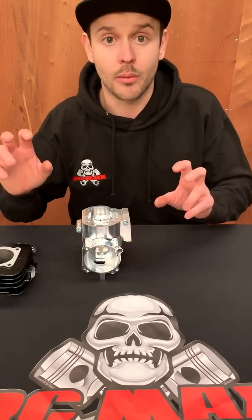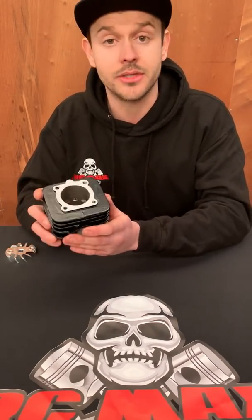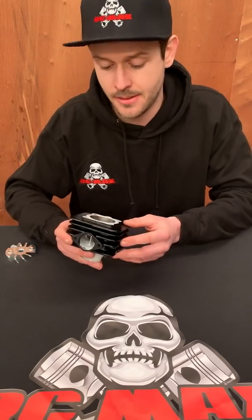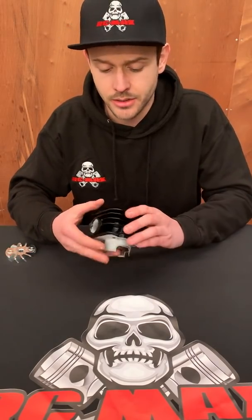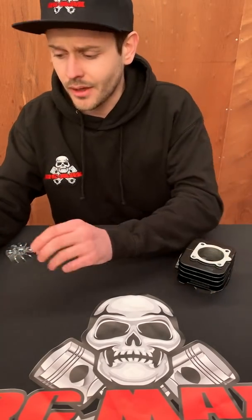The problem is with what we're calling the second tier — the 71-plus. Our supreme cylinder is being used across the board from 55cc up, so we're using the lightweight 47.6 millimeter piston. We're no longer making the 90 GT — if someone wants one, I'll build it, no problem — but we now have a superior option: the 80 supreme. The 71 and 80 are just way too powerful for the 62 millimeter clutch. We experimented with quite a lot of different clutches — steel clutches from 70 to 90 millimeter — and had a lot of problems with heat. Unfortunately the clutch was suffering and we broke quite a lot in testing.